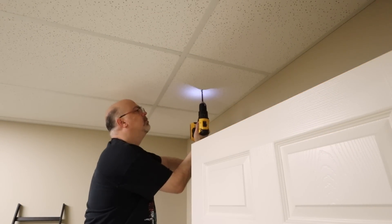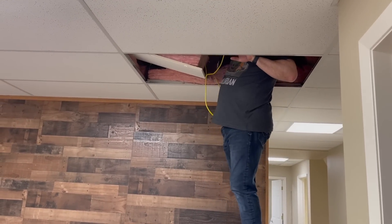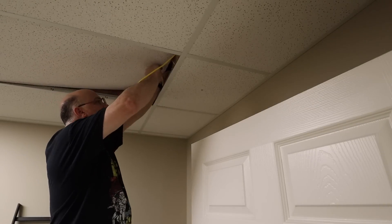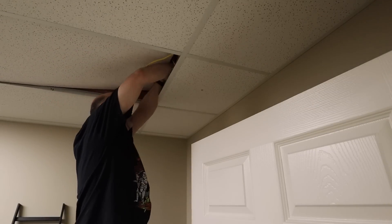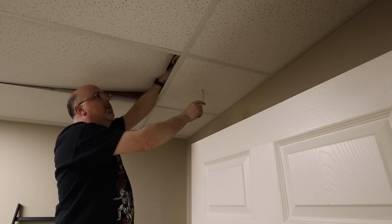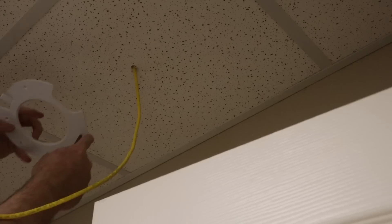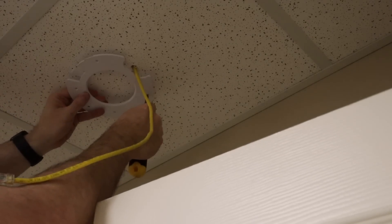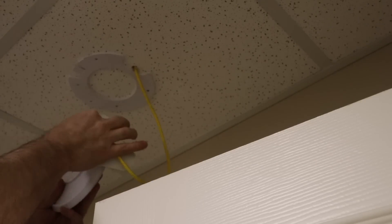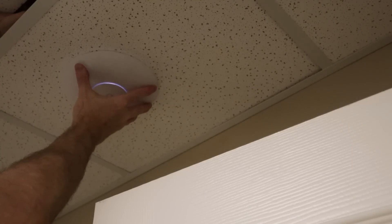With the server room up and running, it was now time to focus on installing all of the wireless access points and the access cameras, and that meant running a ton of cables in the ceiling. I just laid the cables on top of the tiles, but I made sure to run a path where I can come back and add J-hooks at a later point to suspend them from the red iron. Running cables and crimping on ends always takes me back to one of my very first technology jobs. For the wireless access points, I chose Ubiquiti AC Pros, and we'll have several of these around the building, as well as a guest wireless network for our visitors.